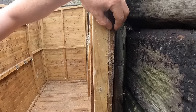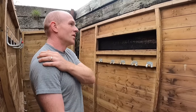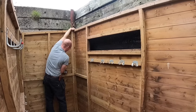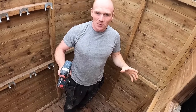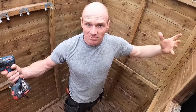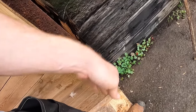Cladding on flat pack sheds is quite often only 8mm or so — this is 12mm. Another tip if you're working alone, which is common in DIY: don't underestimate how useful clamps can be. You can clamp everything — it's like having a second person with you, and they can't argue back. I'll leave this a little loose so we can get everything tight before fixing it down.